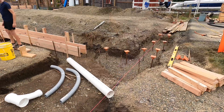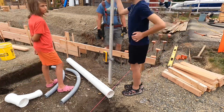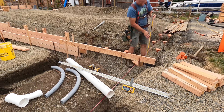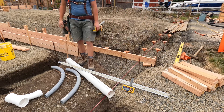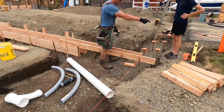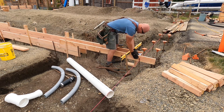When you get to the corners you've got to pay close attention. Here is an outside corner — I got my string lines up and I'm checking to make sure that I'm long enough in the right spot. You plumb down and put a mark on it. I got my string line going up the other direction so I can put my outside two-by-six form on the other side as well. Making sure they're in the correct spot — those marks allow me to cut the correct length of board for the inside corner to make that turn.